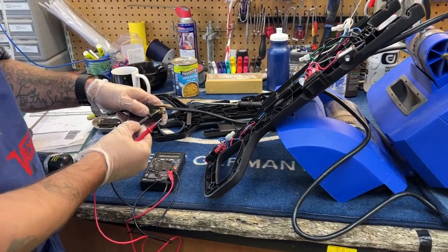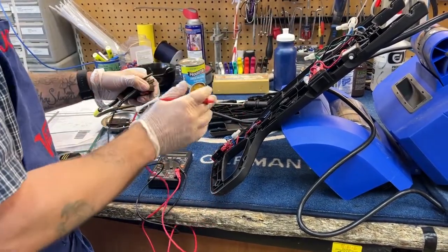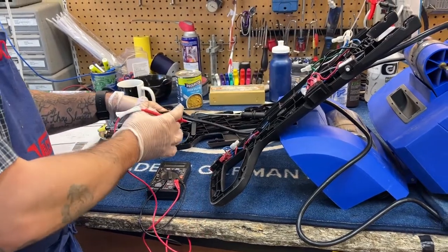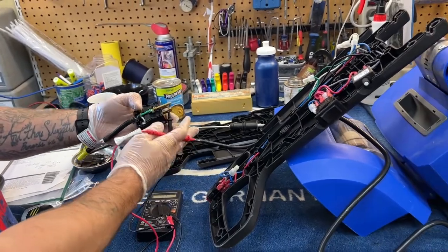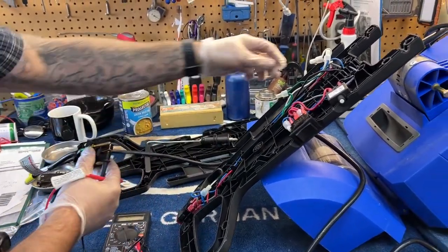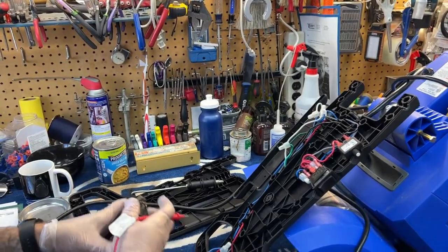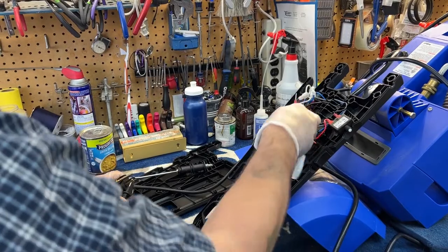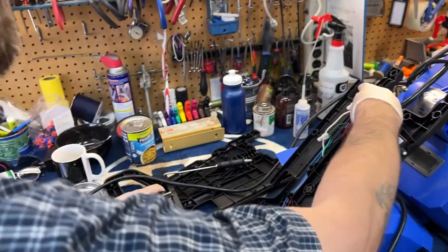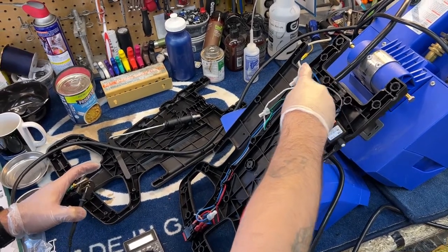On one side I'm going to touch one side of this and find the cord on the other side. It looks like white — okay, I'm on white this side. So out here we see the white cord coming into the back of the machine from the main power. I'm just going to take the tip of the other end of my multimeter and push it in there. You can hear my multimeter is beeping, telling me I have continuity — that side of the cord is good.